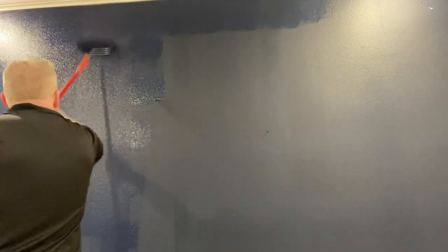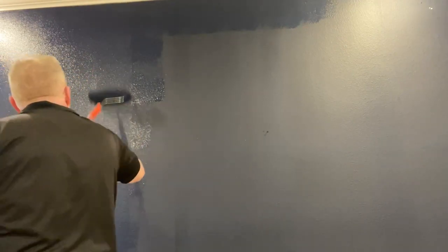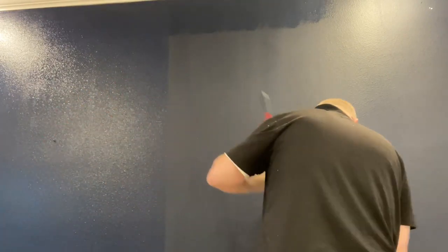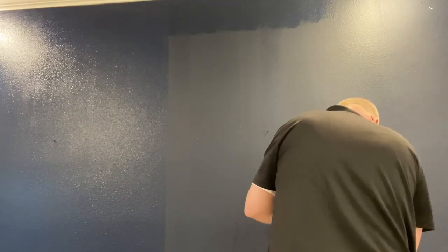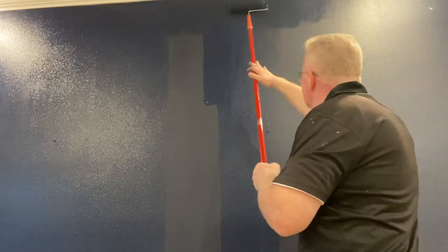But sometimes, if you guys don't know how to roll a wall, and you're rolling it in the wrong direction and your elbow's on the left and you're rolling toward the right, well, guess what? You're making ridges on the wall and you're not rolling them over because your roller is inverted in your hands. And so if you're moving toward the right-hand side of the room, rolling the wall, the roller elbow will be on the side of your body in the direction you're painting.